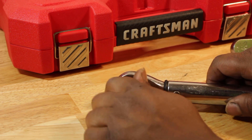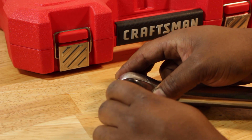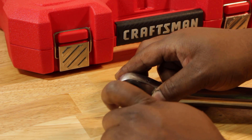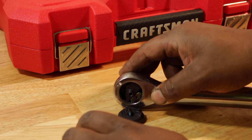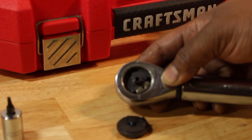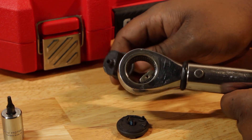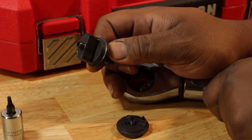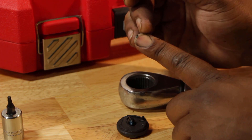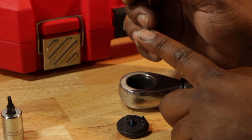We're going to see if this kit will work. I hope it will, because the kit that I purchased — that 43445 — is actually discontinued. It looks like it is the same part. I'm going to inspect the mechanism. Here is one of the gears, and as soon as I took it out you can see there is some metal shavings on the internal gear.